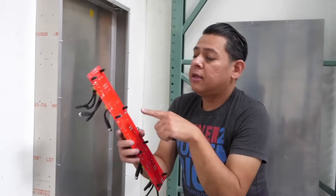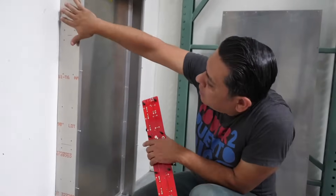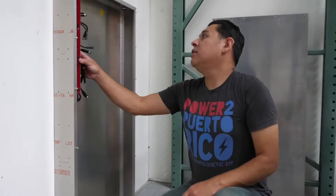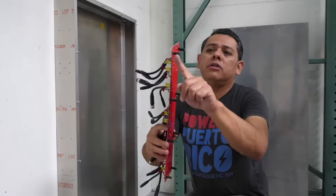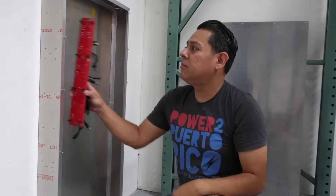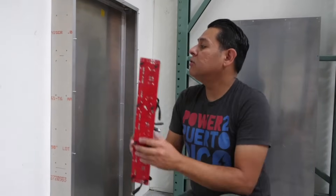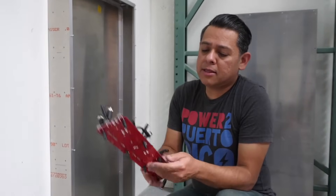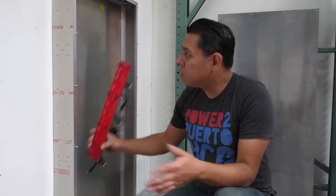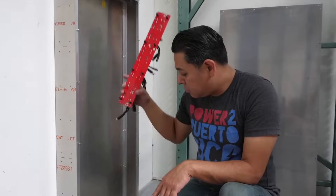If you want to build a bigger battery, you can keep adding boards. In this case we're using two for 20 packs. You drill holes on the side of your enclosure and screw them from the inside. We're using plastic standoffs to keep it isolated from the metallic surface of the enclosure, so it stays nice and isolated. Then we install this Megalodongle into the enclosure with M4 screws.